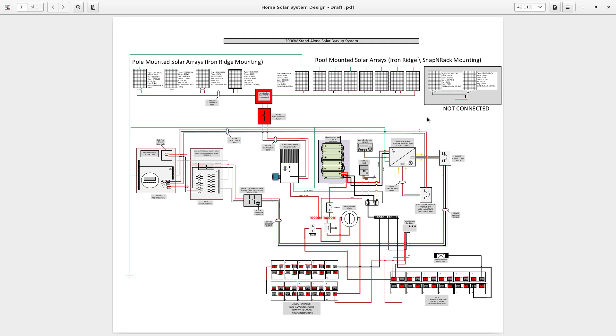You can see that my system equipment is grounded on the AC side through the circuit breakers and wiring — I just don't show it. You'll also notice that the neutral and ground are bonded in only one location: the main panel, as it should be. You can only have one place where neutral and ground are bonded together, and that's typically in the main circuit panel.